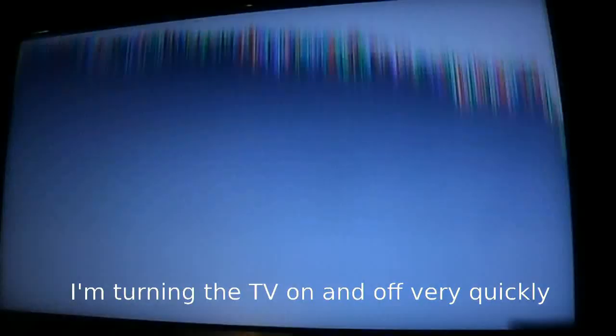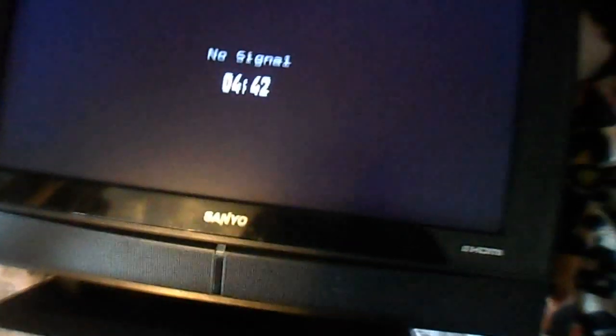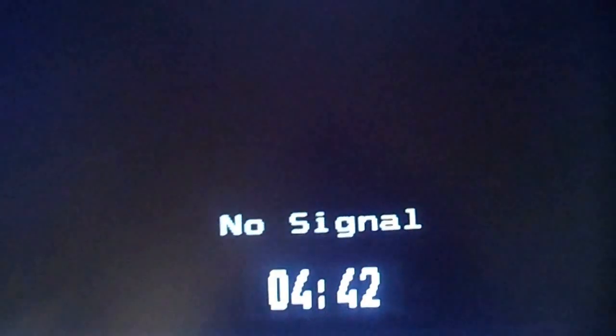The problem is: turn the set on and we get a lit up grey screen, and our power light is lit up rapidly. You can see the pattern changes almost every time - very strange. So there is an issue somewhere. We are powering on and we have got a single frame there - a no signal frame, but notice it is frozen.